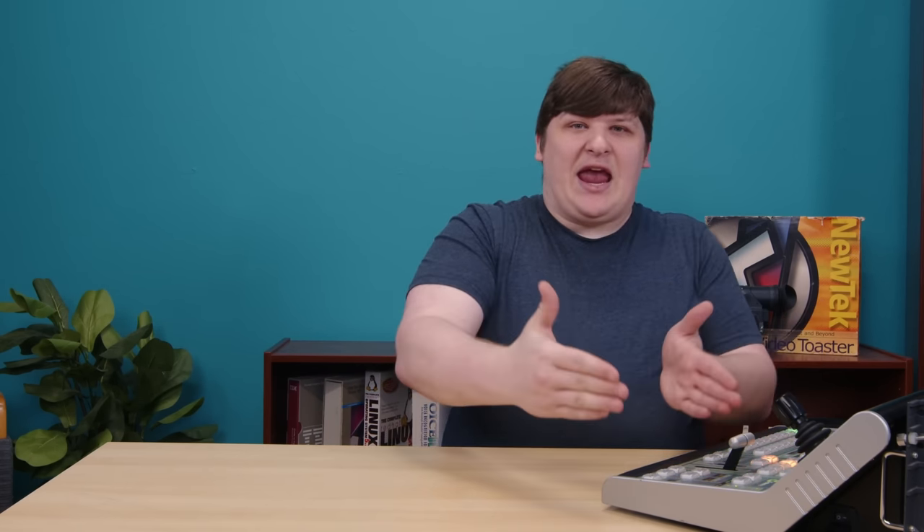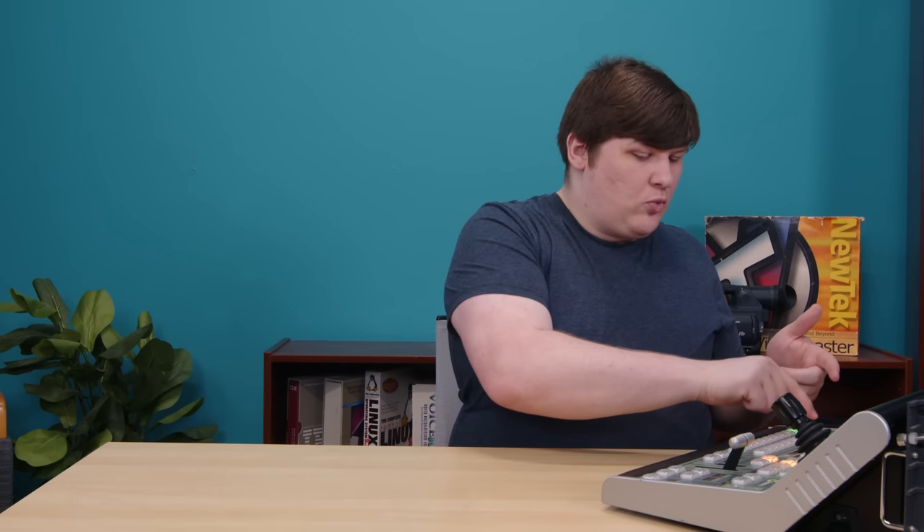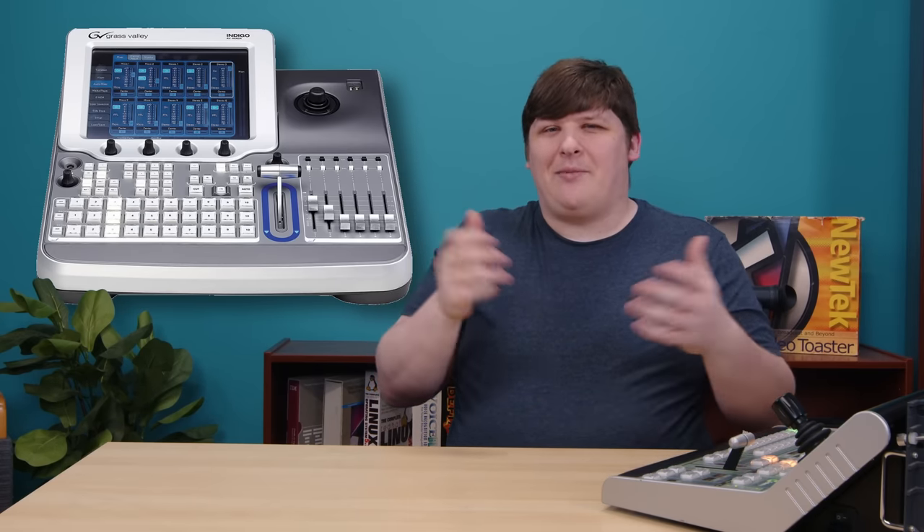If I did a good job with this video, maybe you'll feel the same way now. There is a little bit of mopping up to do. You might be wondering if this has any audio features — no. As far as I know, pretty much no video mixer has anything to do with sound, with the exception of ones that have built-in video players. Typically, video and audio are completely distinct disciplines, and if you think about it, that makes a lot of sense. We could imagine a video mixer with eight inputs and eight audio channels that just ties them together — so when you press camera one it enables the mic associated with camera one. Those exist. The Grass Valley Indigo offers exactly that feature, but it's clearly meant to be a highly compact portable gadget, probably for ad hoc environments like bands playing in the park. But in an actual studio setup, audio is rarely handled that way.